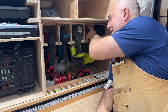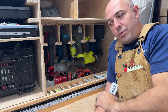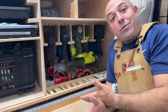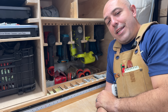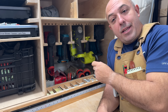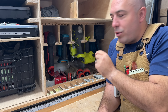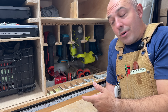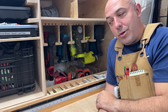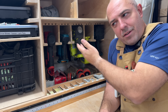The modular holder is done. You can see this is three slots, this is four, three, four — I was able to adjust it based on what the tool needed. I do have to come clean that I had to cut two of these bottom plates to make the tools fit, so that is a negative. One way I could have accounted for that is changing the spacing on the keyholes. But at an inch spacing we have a decent amount of wood between each one — if we went to three-quarters or half an inch we'd have barely any wood left, making it a weaker structure. So this is a head-to-head competition — think of that what you will.